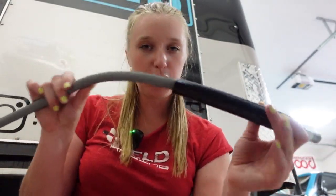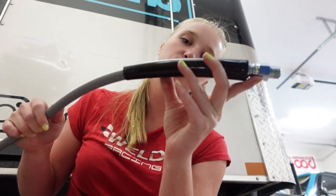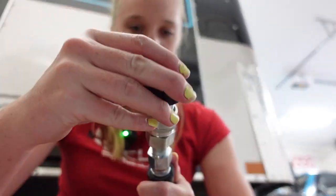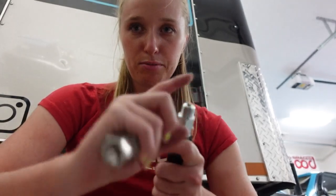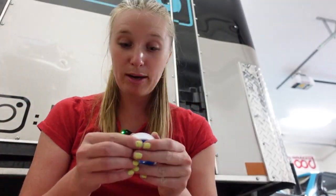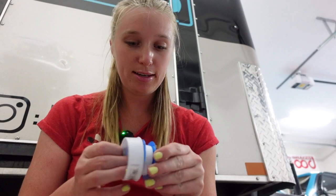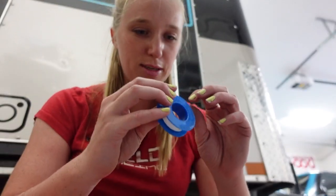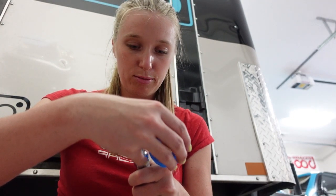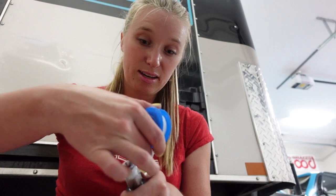It is time to install our Cobra Jet gray hose into our Cox reel. I'm starting with the swivel end — you can see it swivels. Mine came with a fitting that already had plumbing tape on it so I just had to take that off. I ordered extra fittings, which is nice — better to have more than none. You can get plumbing tape, which people also call Teflon tape, at your local Home Depot or Ace Hardware. They say to wrap the threads six times in the direction of the threads.